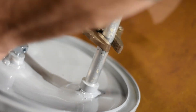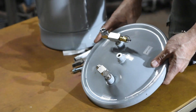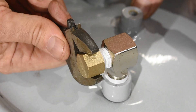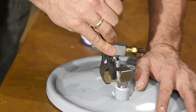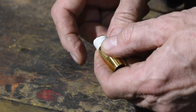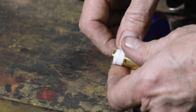I'll start by removing the siphon, which we can screw out and discard. Next, I'll cap the fitting intended for the air outflow line. I've seen guys on the internet who move the pop-off valve there, but I see no reason to do that — pressure is pressure. Anything connected to this chamber measures the same pressure, so there's no good reason to move the pop-off valve. If you haven't worked with pressurized air much before, it's always good practice to wrap the threads with Teflon tape prior to screwing the fittings together. Always remember to put it on in the direction that you're threading, otherwise it tends to screw up as you attach everything.